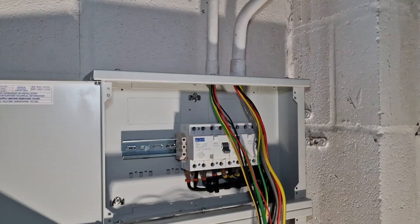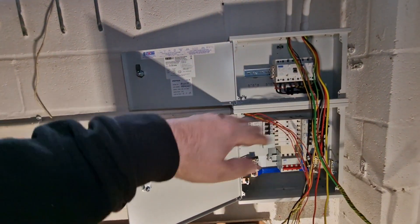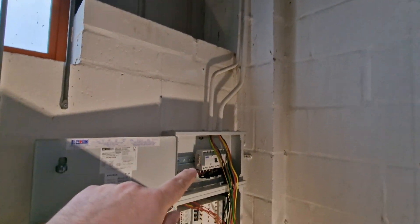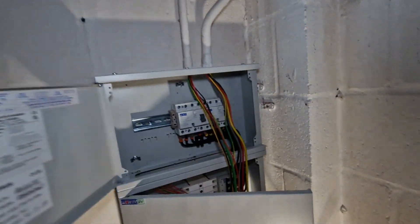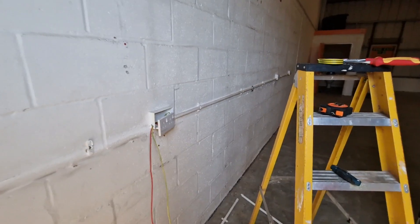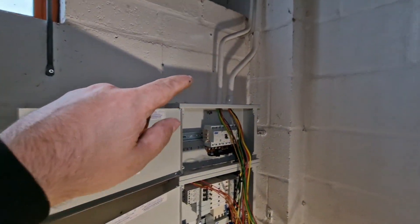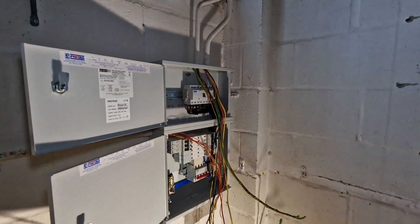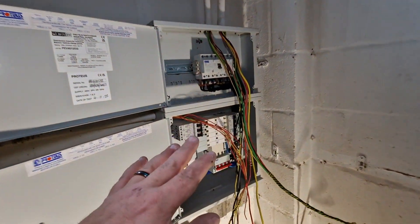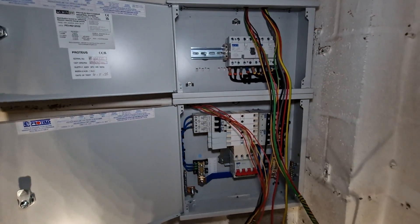I've got the board on the wall now. I've gone for a chest-to-waist height which made more sense, and I've got these tubes adjusted so they just drop straight down into the top nice and straight, then obviously this one coming off from the side goes straight in — they're all tubed in nicely. These are singles. The sockets are disconnected. I think I'm going to drop a socket under the board somewhere just to use in the meantime. When we come to wire out for our other circuits we can just come off the top — there's a nice landing plate there. I don't see the point of sticking containment around it for the number of circuits I'm going to have on this small board. I'm going to take this RCBO out — I think I can just drop the SPD straight on, so that should be straightforward.